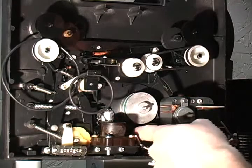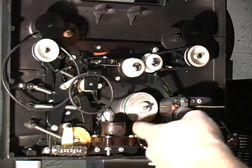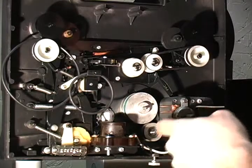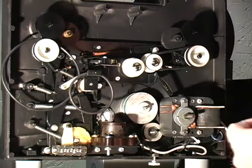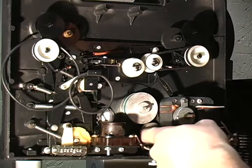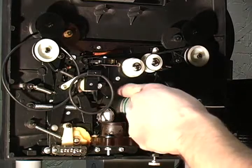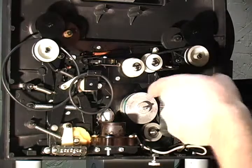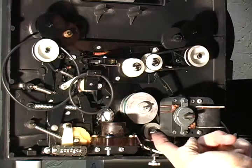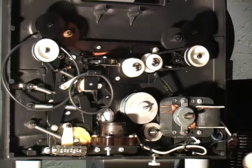Now, a lot of people are thinking that this is too loose. Well, it is and it isn't. You want it to be loose because when the projector engages and it's not in the forward or the reverse position, this is going to spin down here. But the shutter is not going to spin as of yet, not until this gets engaged. That's kind of what the spring is for too — it holds this bottom pulley up, so it gives it a little bit of flexibility there.